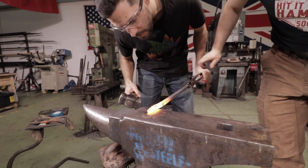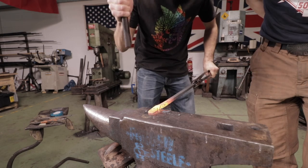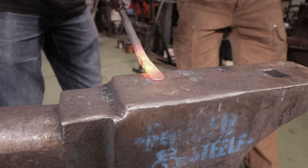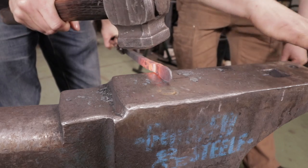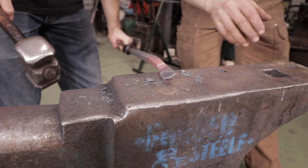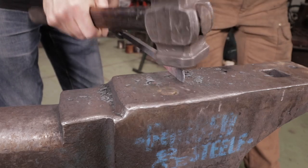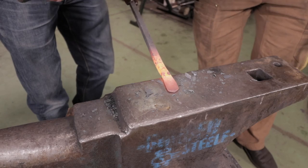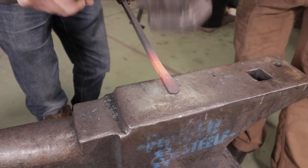You want to keep that material level so that we're on the shoulder. Now we want to straighten it all out. Rotate the bar 90 degrees and come in just about like this — it's a fishtail. Take the flat side of your hammer, tilt it back down so that you match the angle, and then check it back like this. Now rotate it 180 degrees, but as you do, take note of any bends so you can adjust as necessary. You can hit it to straighten it. Just trying to establish a nice clean surface — give it a brush here, and then just gently pat across it so that there's no hammer marks on the whole thing.